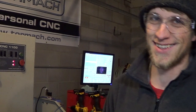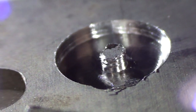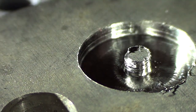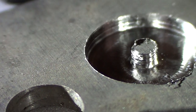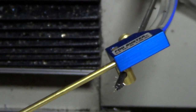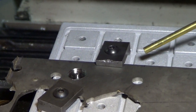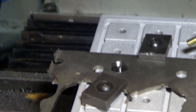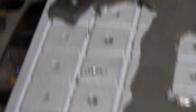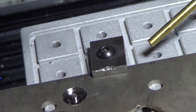That kind of ruins the rest of this project. You can see right there on the left-hand side of this stub — it's hard to focus on properly, but there's kind of a goober, a section of balled-up metal, and that's most likely where it broke. We're wondering if this thing needs more lubrication while thread milling. I just had an air blast, not even the coolant turned on, which was probably foolish. Either lubrication or flood coolant. That little balled-up section is most likely what caused it to break — we've got to figure out why that happened in the first place.